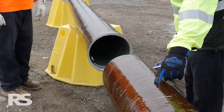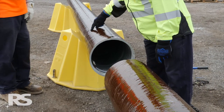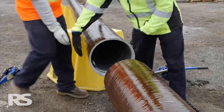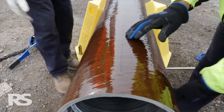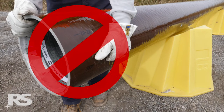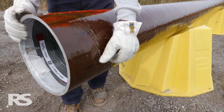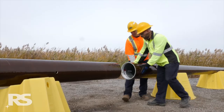Align the modules with the pre-printed b-axis facing up. The alignment lines are printed on the b-axis along the length of the module. Match up the alignment lines on the two modules with each other. Be mindful of pinch points when aligning the poles — hands should be placed on the outside of the upper module. Use caution if the module is wet because the surface will be slippery.